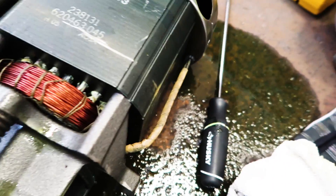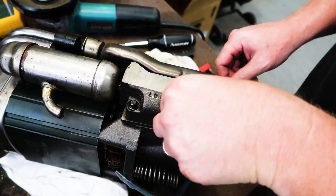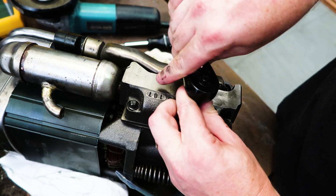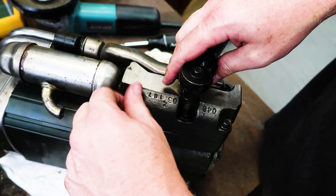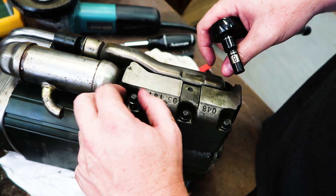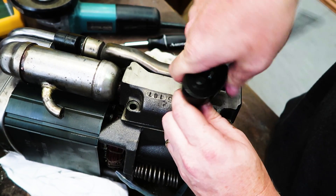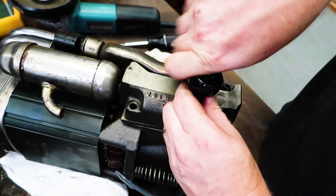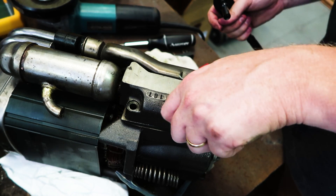I got this off with a Torx — these are 8 metric, I think. We actually dug around in the oil and there was a lot more nasty material in there than I had initially thought. In a lot of cases these things run hot over time. They may be getting liquid floodback, which washes out the oil, and then over time everything breaks down. Although I will say that looking at the crankshaft side, it doesn't look that bad. I'm no compressor teardown expert, so I really shouldn't be talking too much about what's acceptable and unacceptable.